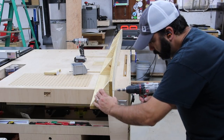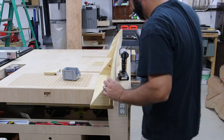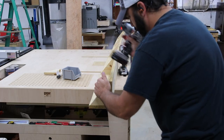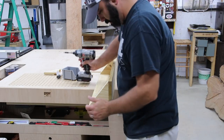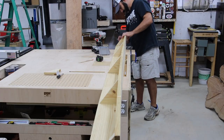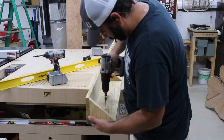I'm going to add some supports and I put this first screw in. You'll see some daylight between the support and the shelf right there, so I'm just going to add a screw in there to bring it in and close that gap up — and that did the trick. I'm going to do this all the way down. I think I've got like five supports in there. A few would have been sufficient, but I had the wood, so I just went ahead and put several in there.